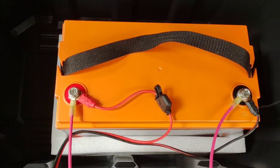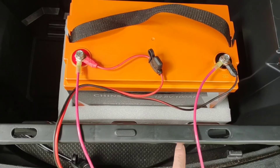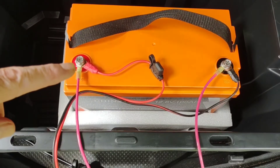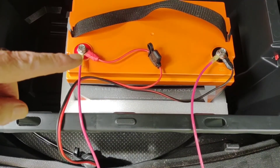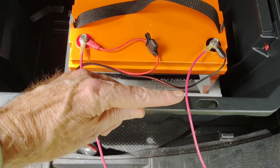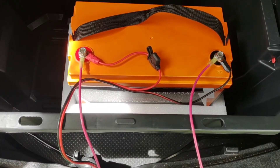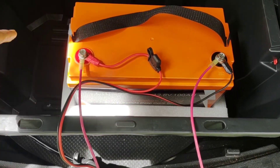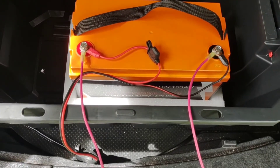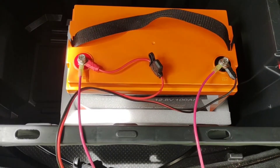One of the things I want to do first is drill through the sidewalls here, just big enough to insert that 10 gauge wire through. I'm going to take the battery terminal clip adapters off, drill a couple of holes big enough to feed those wires through, then refasten them. The inverter wires come off on the other side, but I've got it so I can tuck the inverter in here or put it on top — I'll show you a couple of different configurations. It's super simple and not taking very long at all.